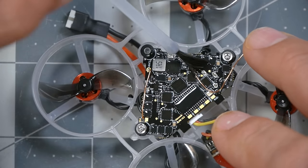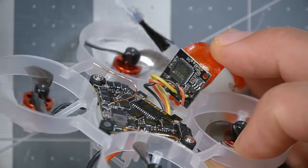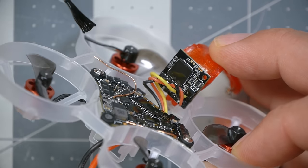Get it all on there and then let it dry. The camera brings us to the first thing you don't want to get conformal coating on. There are some things that will just be damaged by the chemicals in the conformal coating, and the camera's sensor is one of those things. You're going to have to be very careful to either not brush it onto the sensor itself, or you could mask off the sensor in some way. That's part of the reason I don't suggest the spray-on application, because if you get conformal coating where it's not supposed to go, you will damage things.